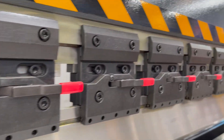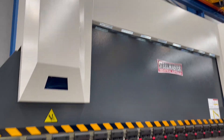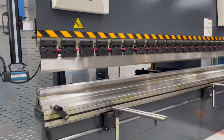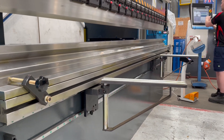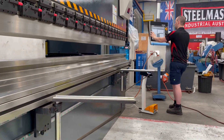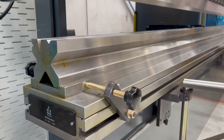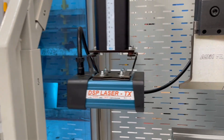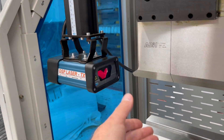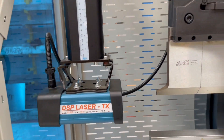Quick-action tooling clamps, as you can see on all of our CNC press brakes. We have LED lights across the top to illuminate the operator's working area, which makes it a more enjoyable environment to work in. We've got linear-scale guide front swivel sheet supports on the front of the machine, which are also T-slotted so you can position those anywhere you like. DSP Italian laser guards allow the operator to work in nice and close to the tooling — perfect for small box folding applications.